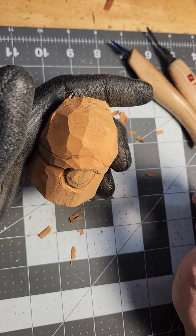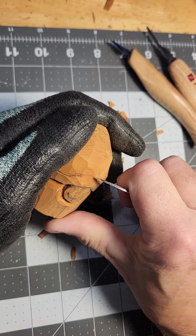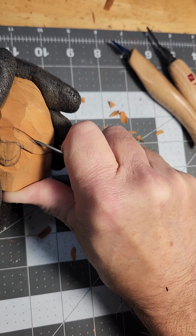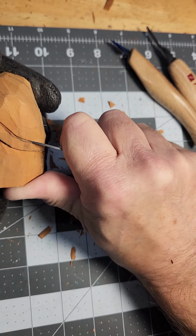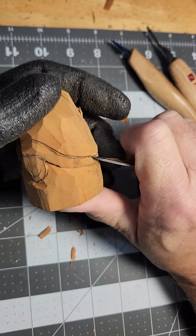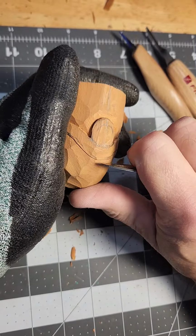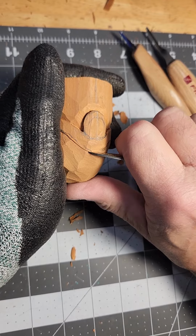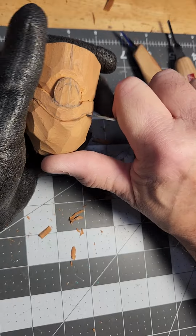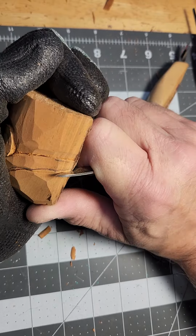All right. Okay, now we're going to go up to the rim of the hat. We're going to trace this one out. Okay, so this is starting to center. Carefully. You don't want to go as deep as you did on the bottom. I mean, you can get away with an eighth of an inch, I suppose. We'll flip our piece over. Come around. Get to the edge, make that rocking cut.